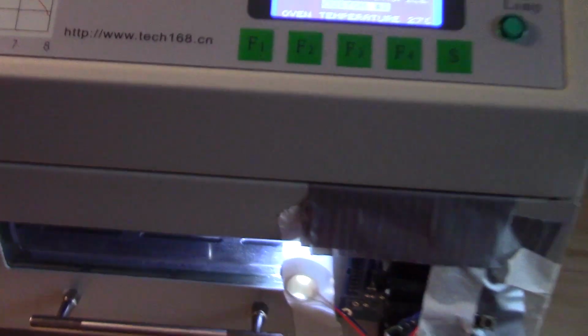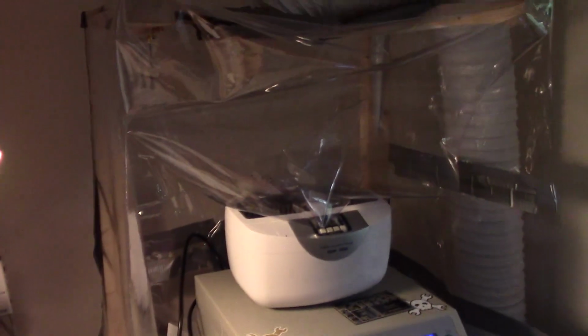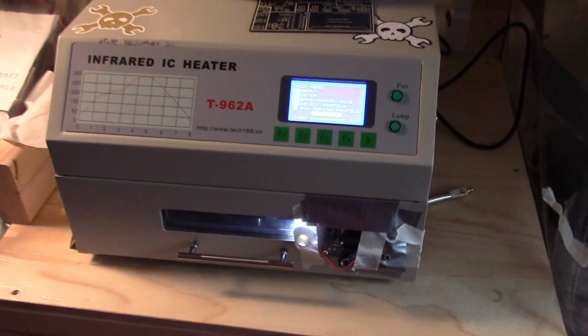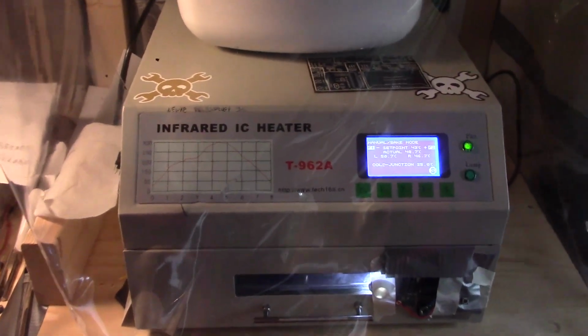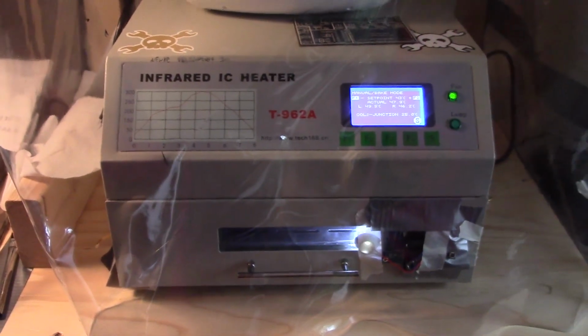And we can look in through the oven front and watch the stuff reflow. You can see on the outside here there's a fume hood built around it, so I'll pull that forward. The fume hood's built on an exhaust fan, and in the output it has an active charcoal filter, which is actually a car interior cabin filter. Alright, so now the exhaust is set up and the oven is starting to warm up. I'm gently bringing it up to temperature and then I'll run a profile and you can hopefully watch the reflow.